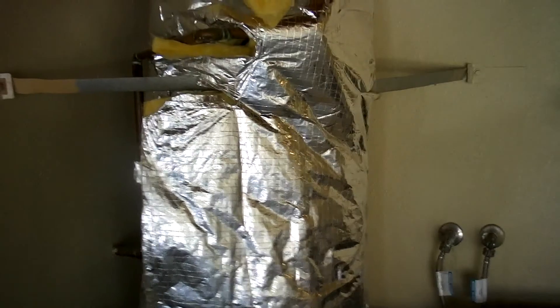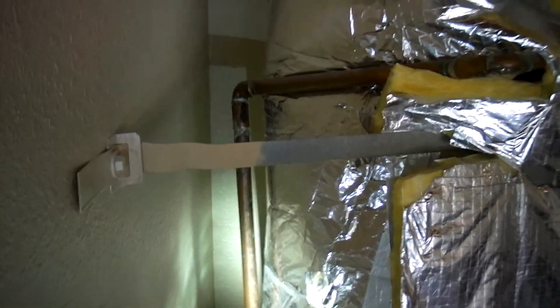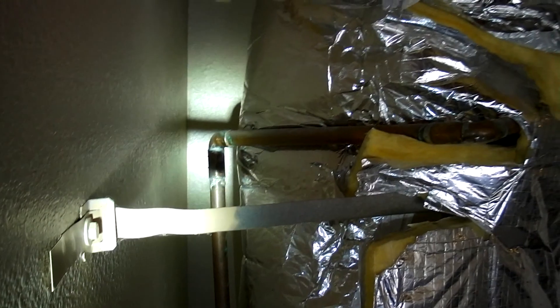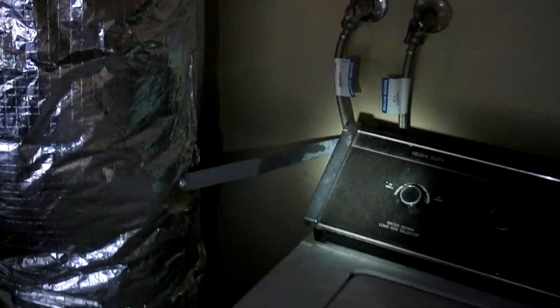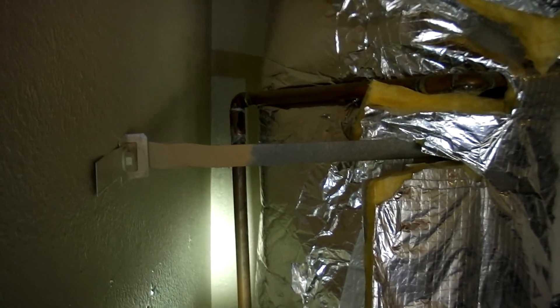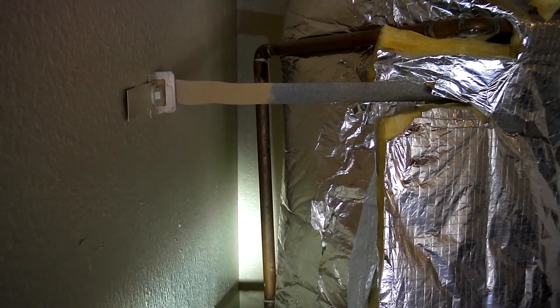So this should be repaired to make sure this water heater meets the FVIR requirements. Then let's take a look at the seismic strapping on this appliance, and this is something I see quite often. The water heater itself sits off the wall approximately eight inches and there's no blocking or bracing behind the water heater itself. So even though the seismic strapping is on there — one on the top third, one on the bottom third — there should be some type of blocking or bracing behind the appliance so that no lateral movement can occur in the event of seismic activity.